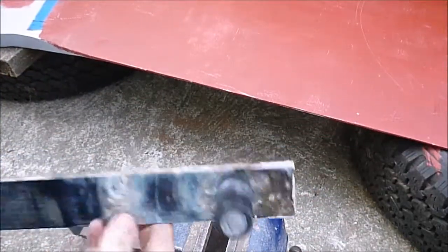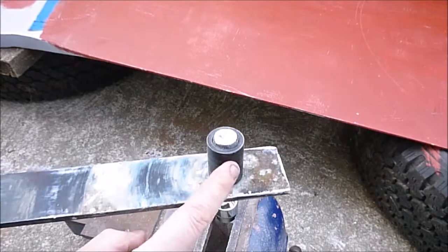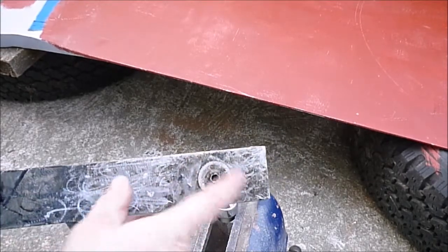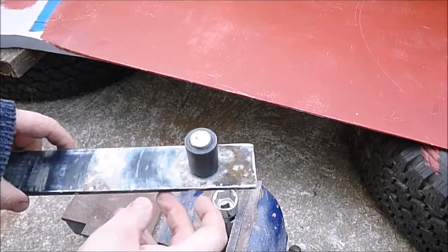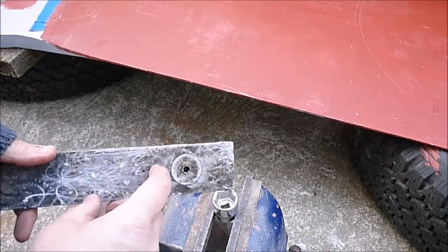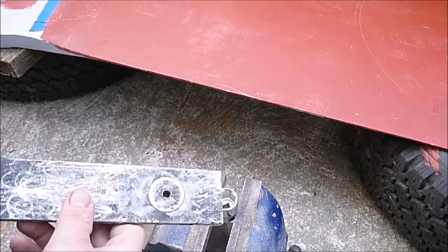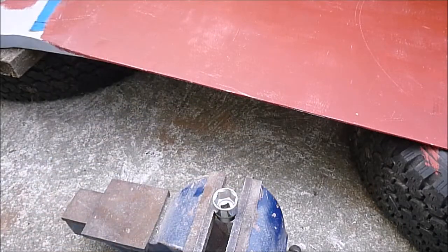To save some money, rather than buying everything, we're probably just going to have to buy the bushing and the bolt again. So we're going to try and remove this from the strap without damaging it. Talking to Reid Marine again, he says you should just be able to support around here and whack here, and then that should come out of the bushing so the bushing will be able to come clear. I'm going to use a vise and a large socket and hopefully that'll work.